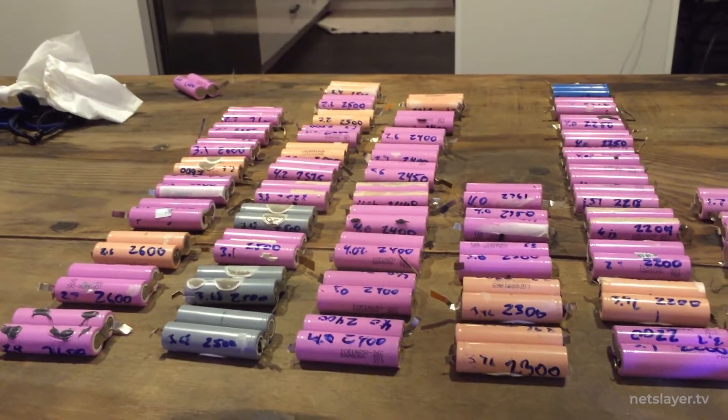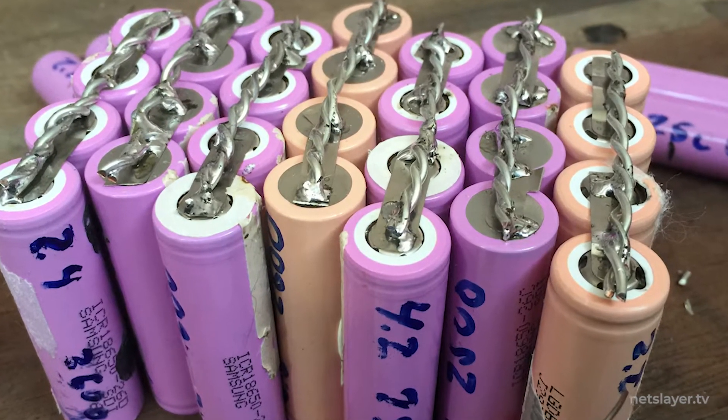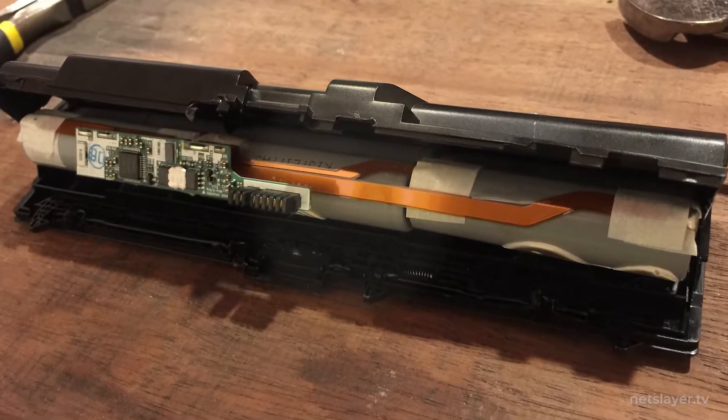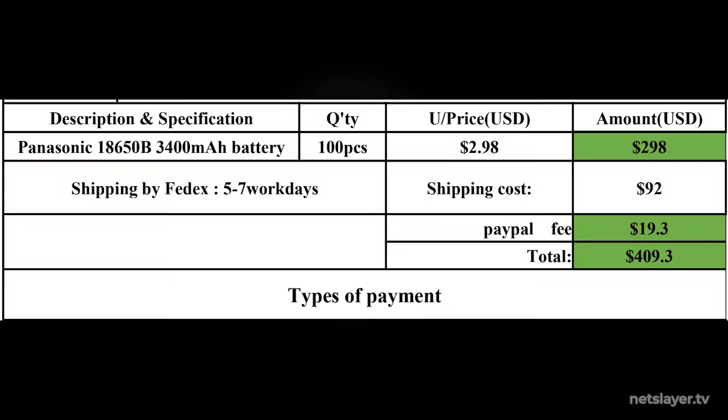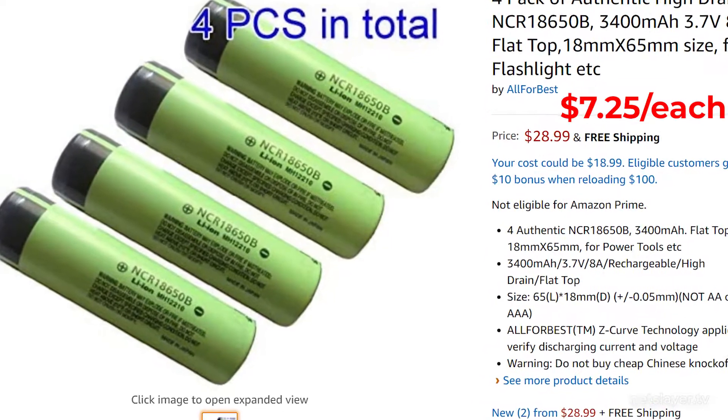Compared to the previous ArcGuard, which used older first-generation 18650 cells rated at about 2,400 or 2,200 milliamp hours brand new, those used laptop batteries were down to around 2,000 milliamp hours. This new cell has 3,400, so with the same cell count I'd have 50% more capacity. I decided to use NCR 18650B cells and ordered them in bulk from Alibaba — a few hundred cells per vendor got me a bulk discount, bringing the cost down to around $3.30–$3.40 per cell versus nearly $6–$7 on Amazon.